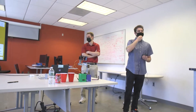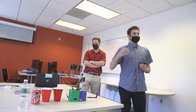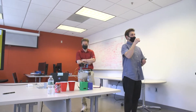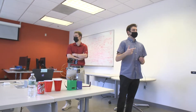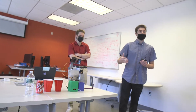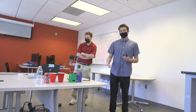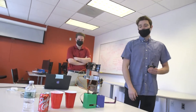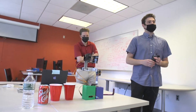We have a 12-volt battery powering everything in the gimbal device and we wanted to use just one battery source. Before, we were using a portable charger and a 12-volt battery, but we figured out how to power the TNC along with the servos from the same power source. That keeps it much more compact with fewer components involved. Keeping it as small as possible, we were able to stick to one battery source — if you were to open this up, you'd see it on the side. It's truly not that much in there; we were able to keep it pretty small and all together.